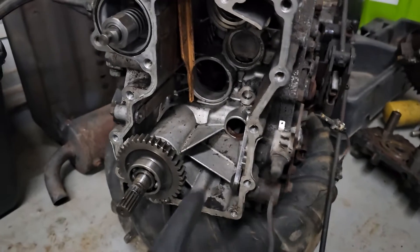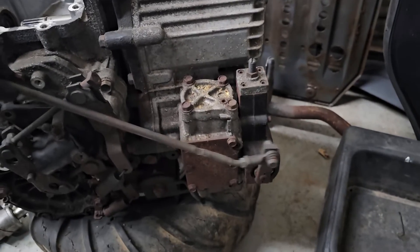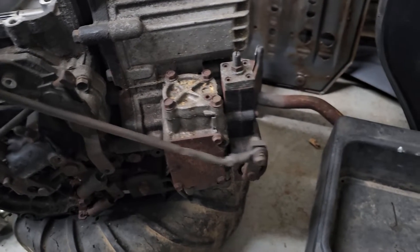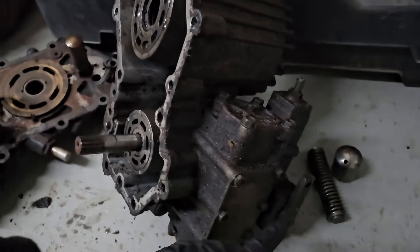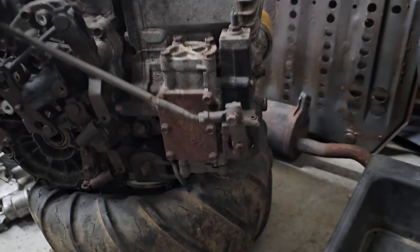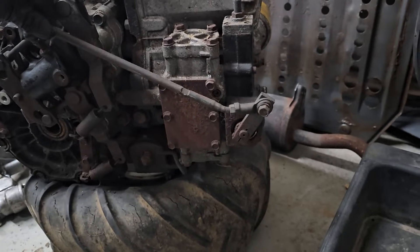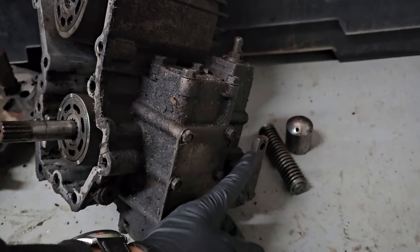The shaft from the engine side is kind of long and goes straight through down to your hydrostatic motor. If you watched that last video, this is the valve that operates the hydrostatic section, and that valve can be found right here. We adjusted this line to make sure you're going forward - if you pull this back, you'd go backwards. Push forward, this is forward like that, right here on this section.